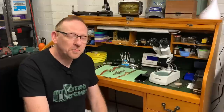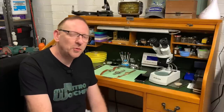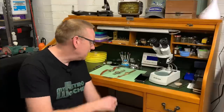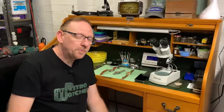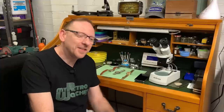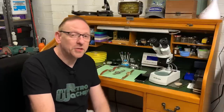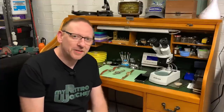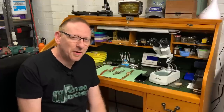These movements are absolutely fantastic. If you don't know much about the Bulova, they made this tuning fork — it's a sort of early electronic watch. I think it came out in 1960 as the Bulova 214, which became quite an iconic watch. It then had a space view version which was really nice. Basically, a little circuit puts power into some coils which interferes with some magnets and makes a tuning fork vibrate at a particular frequency, and that is transferred into motion by the index system — which is a sight to behold. The 214 was upgraded to the 218, I think in 1965.